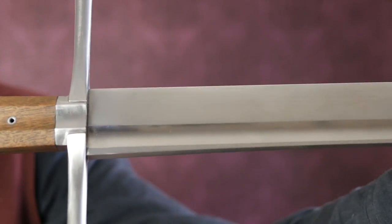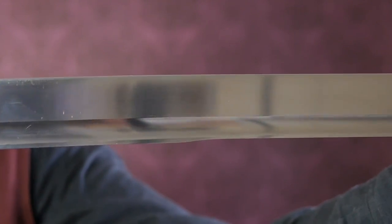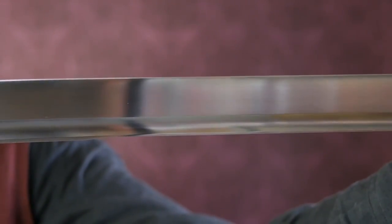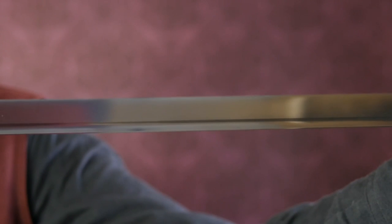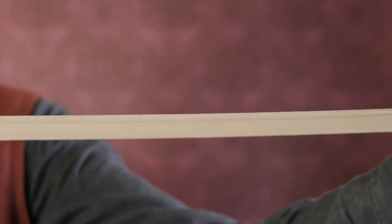That's a lot of money to invest in a hobby — what do you get for it? Well, the blade is made of 6150 steel, which is a fine-grained carbon-chromium alloy steel excellent in terms of shock and abrasion resistance as well as toughness. Albion blades seem to have an average Rockwell hardness of 54.5, which is a very good balance between strength and toughness.